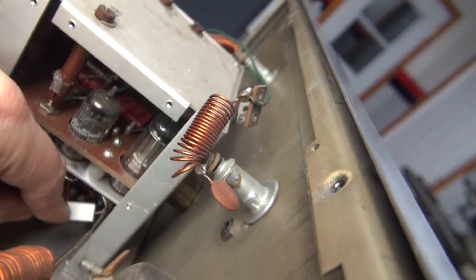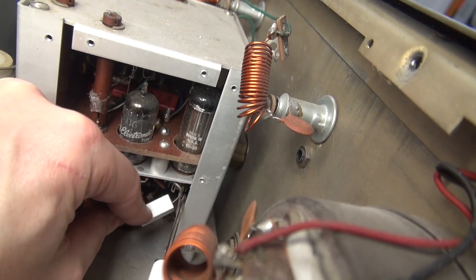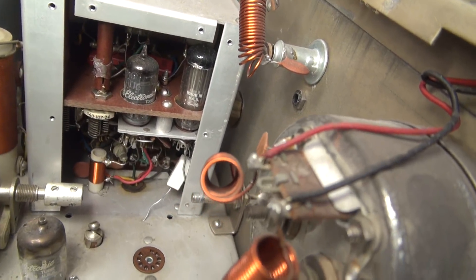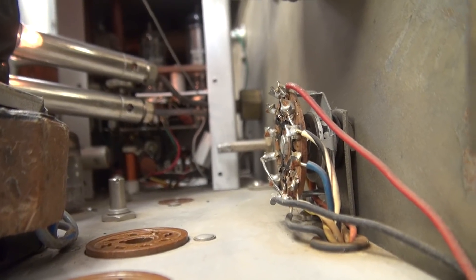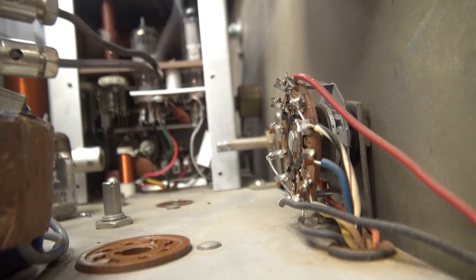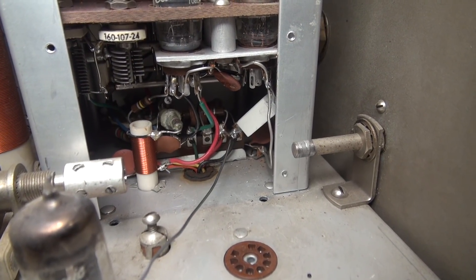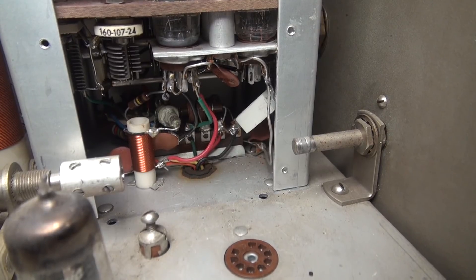Here's the 20K. I've cut this lead and made a little hook. So I'm going to get in here and swing it up into place. Get that lead back into that tube pin. You may have a problem clearing the hole in the tube, so take some solder wick, get it in there and pull that old solder out of the tube pin. It's very difficult — there's a ground runner coming up right in your way, but behind it is the pin that you need to solder to. I've got the new resistor hooked in there in place. Now I need to bring my soldering iron back here and solder it in. This thing's really being a pain, so I'm taking a Weller and I bent the tip to be able to reach around that corner and solder this in. Got it. So I made two little J-hooks on these leads so that's a solid mechanical connection. The upper connection is done. The resistor is in a great position — this is going to be a success.